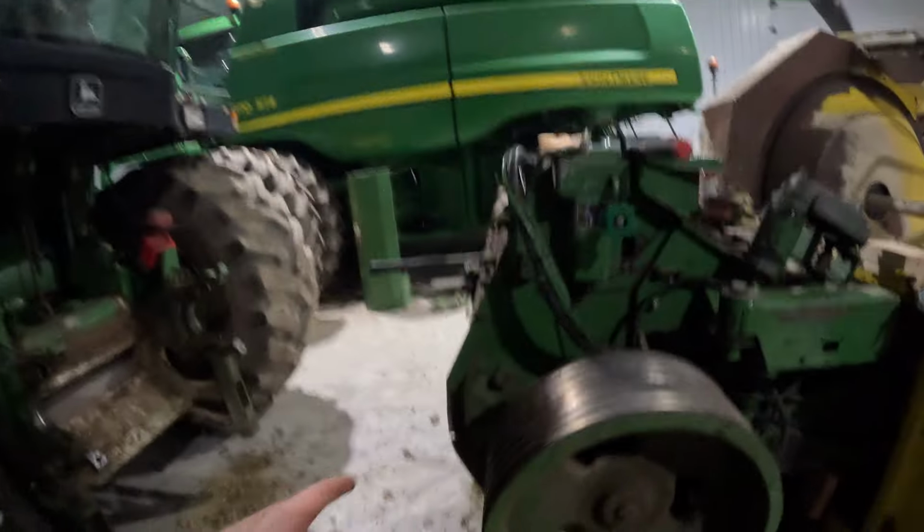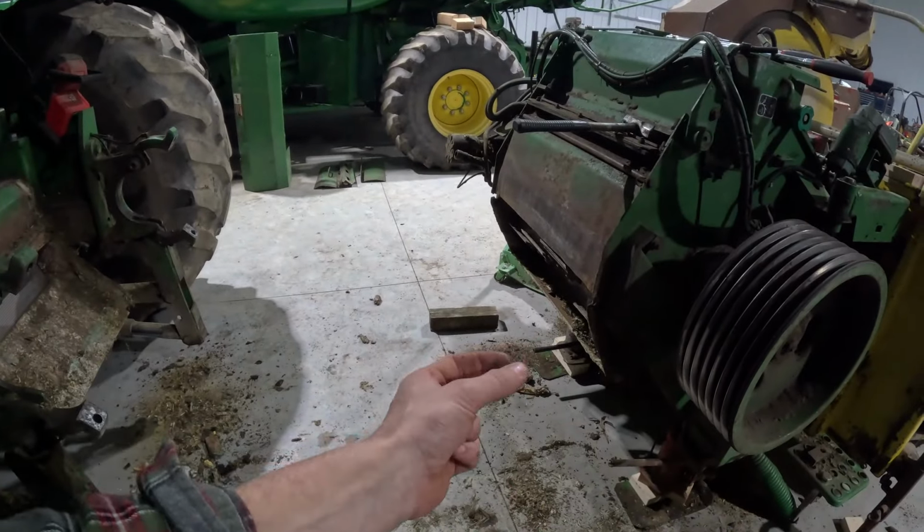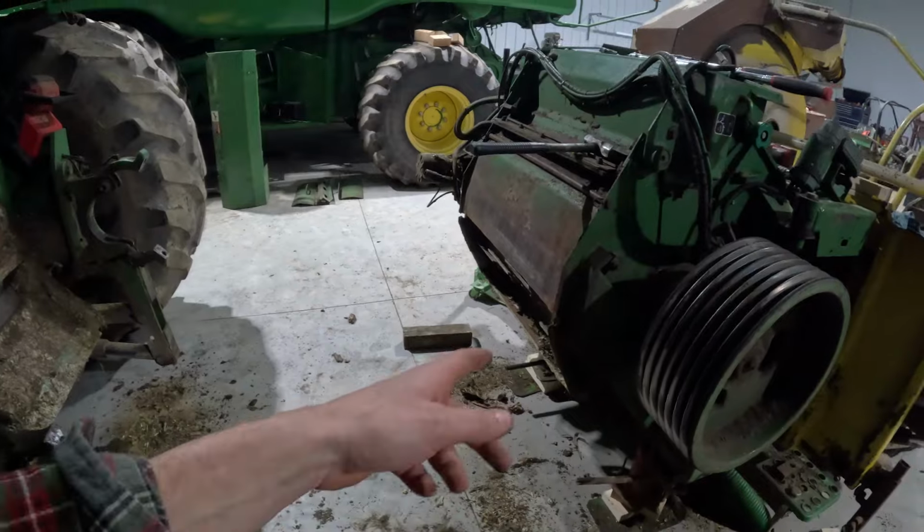torque wrench, because these, if you tighten these down too much, they create stress fractures in them, and then you start breaking knives out. We found that out on our, what we have, a 58-30, I think a 58-30 or 58-20 self-propelled chopper, and we were breaking knives in it like crazy. Well, what we were doing was taking the old Milwaukee Impact and running them down. Well, once we got this one, we looked into that a little bit better, and you're supposed to torque them down to, I think like 175, 180, something like that. I'll have to re-look that up, but you torque them too much, then they crack them.